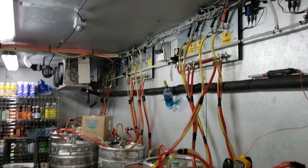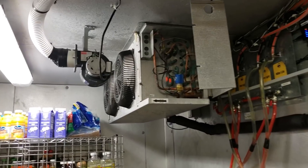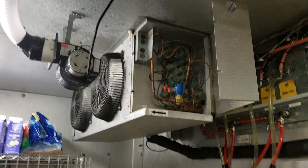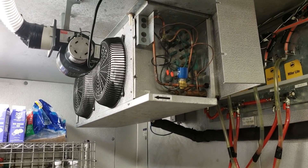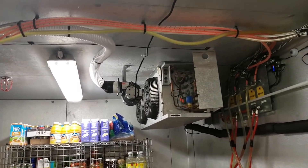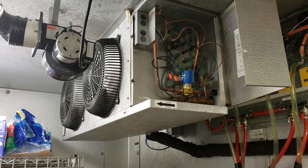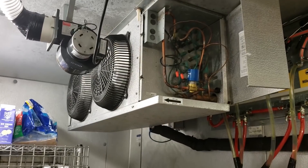This whole job is turning into a debacle. Air temperature right now is 33 degrees in the box — that's what we want. I got the superheat pretty much dialed in but I'm still not happy with how that valve is operating; the spring inside might be screwed up. That solenoid valve was doing something funky too — it burnt the coil out, so something might be stuck in there. This coil seems to be working okay. They want to maintain about 34 degrees, so I'm adjusting the temperature controller. I also had to put 7 pounds of gas in because the sight glass is flashing, so there's obviously a leak somewhere. Once I get the temperature controller dialed in I'll shut off the condensing unit, do a leak check, then submit quotes for everything.